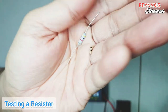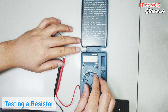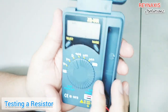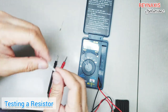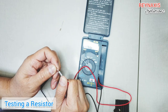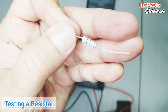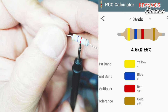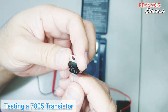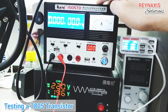Let's see if this multimeter can give us a correct reading for resistors. I'll switch it to ohms mode, which is the third position. It's showing 4.6 kilo ohms. Now if we read the band, it has yellow, blue, red, and gold colors — so that's 4.6 kilo ohms, which matches.